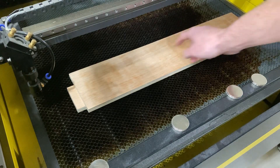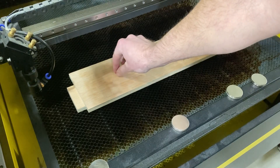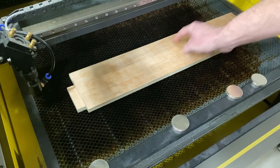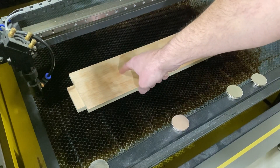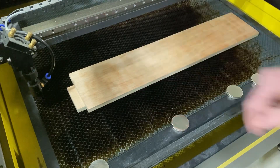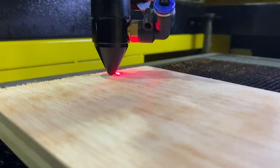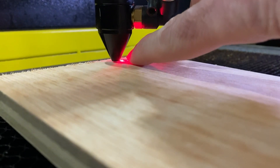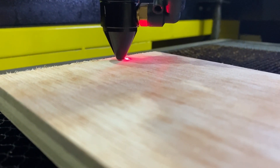The results we're looking for is a thicker line that narrows down to almost a needle point, and then starts to get thicker again. At that needle point, that is where our optimal focal length is — that's going to be the best spot to get good cuts. I just wanted to get in here nice and close so you can see that the cone of the laser is almost touching the material. You want to get it as close as you can for the best results.